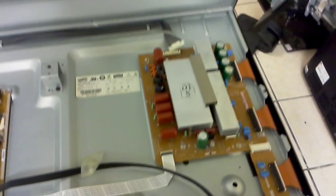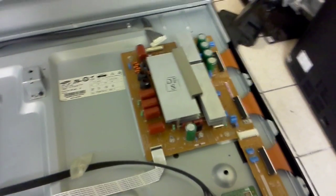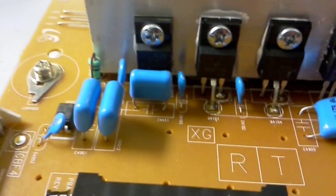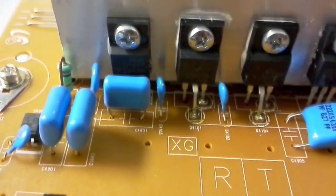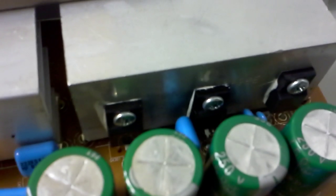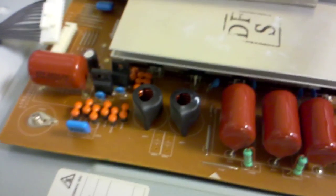How did we repair it? I ended up replacing most of the power transistors that were on the board — the sustain and recovery generation transistors. Those two were replaced. I remember two here were replaced, maybe the second two if memory serves me well. One was a rectifier, another transistor, there was something on this side as well, and oftentimes on the back side there are also other parts that need to be replaced.